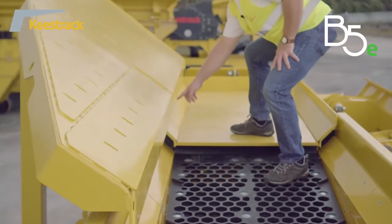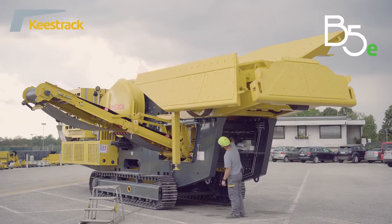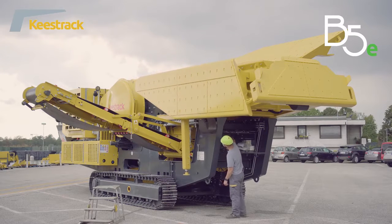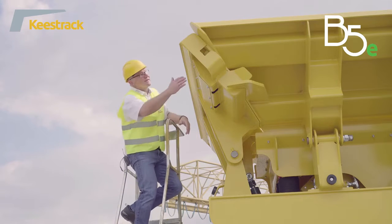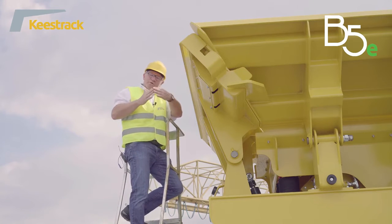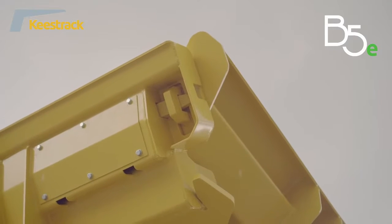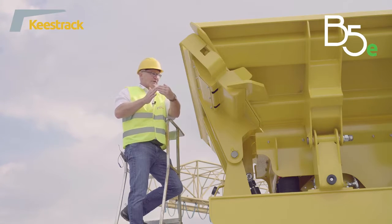The hopper walls can fold down hydraulically. The hydraulic cylinders are protected by rubber against falling stones. The hopper walls are folding fully hydraulically, and the folding mechanism we can see here in this area. So the fixation of one hopper wall to the next hopper wall is done via a hydraulic cylinder without one bolt, without climbing up. So it is a very, very safe operation from the bottom.